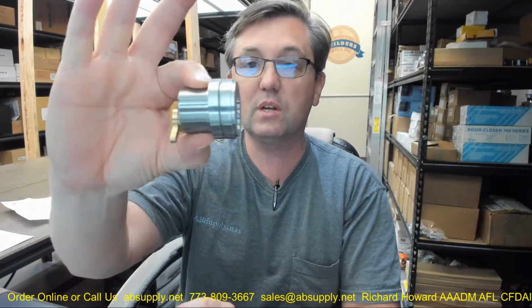And that is handy because it will sit underneath the head of the cylinder, and as you tighten it, you'll compress that wave spring just a little bit and get that snugged up tight there. It also includes a blocking ring. So the 80-101, that part number inherently includes all of that material like you see there. The reason is because this is a small format interchangeable core cylinder, and that inherently forces them to be longer. This should be 1 3/8 length.